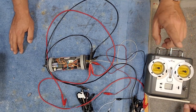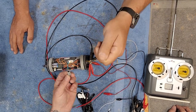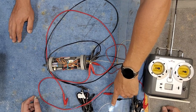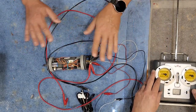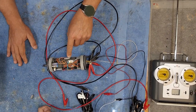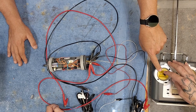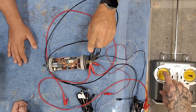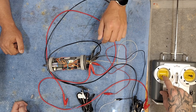Jason just turned the radio on and is going to power on the unit. We've moved away from a mechanical switch to a magnetic one. All you do is take a magnet and swipe it - power came on with the light here. You didn't hear any beeps because this speed controller needs to be in the zero position to start, and this transmitter is in the center which is 50% throttle. These are one-way, one-direction speed controllers, so all the way down means it's off.